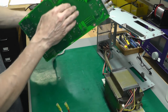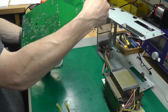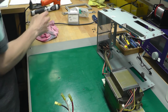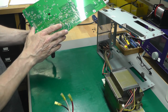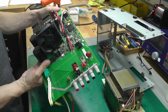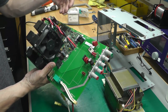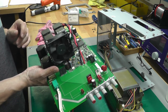The circuit board is quite warm but not hot to touch, which helps with evaporation. I've been using a heat gun to dry off circuit boards for 30 years — as long as you know what you're doing, there's no problem. You just have to be careful to spread the heat around and not concentrate it too much in one place. Underneath the ICs will still be quite wet, but heating the underside of the board as well gives a chance for the heat to soak through and for moisture to evaporate.